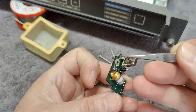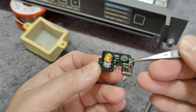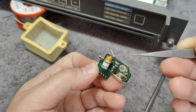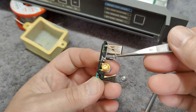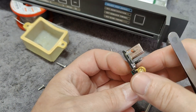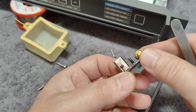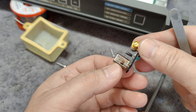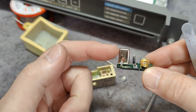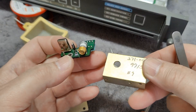What the heck is that? This is a little cut from a wire - when they hand-soldered this they cut it and it went flying and nobody saw it, so it's been lying there for all those years and almost touched one of the pins of the crystal. That is a quality issue. The crystal here is 17.734 MHz and something more, and it's from 96 week 48. I was hoping to find a 10 MHz crystal here because then I'd know the crystal, heater, and temperature sensors are all matched, as this is a really nice case.